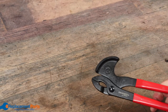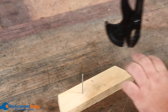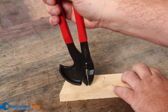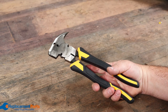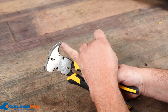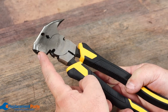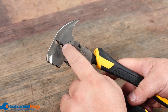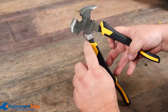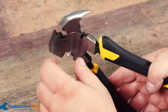Then we also get into other more unique pliers. This one, believe it or not, is actually a nail puller — you grab onto your nail and rock across to yank it out. Then we have one of my favorites because it's a multi-function tool: fencing pliers. The fencing pliers has an end for yanking out your staples on fence posts on your farm, for hammering in your staples, for catching the very end of your staples to start pulling them out, for crimping your staples a bit more, and of course built in as well are cutters for cutting your barbed wire and everything else.